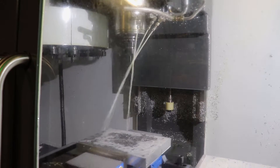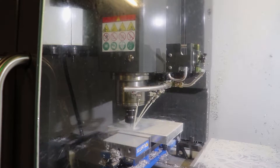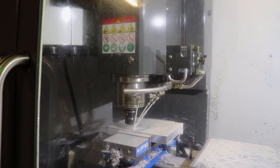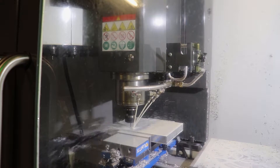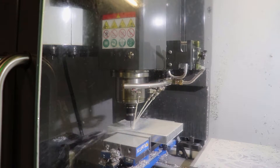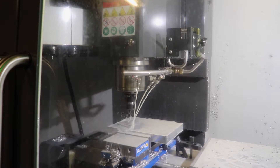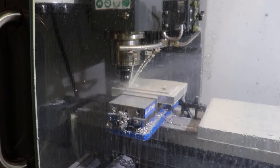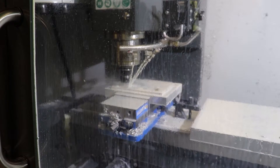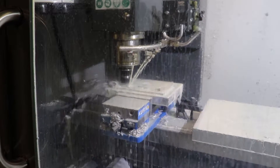Step 4: Remove the workpiece and run a CNC program which drills and taps into the aluminum base plate. Step 5: Finally we can attach the workpiece fully and run the CNC program to cut out whatever we want — in this case, a simple component which will be used as a fixture for the balance wheel.